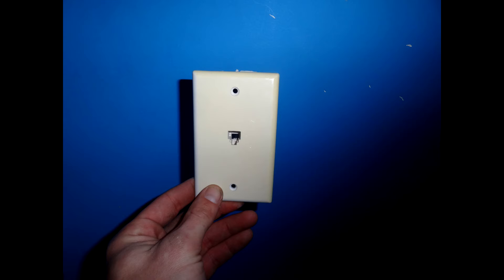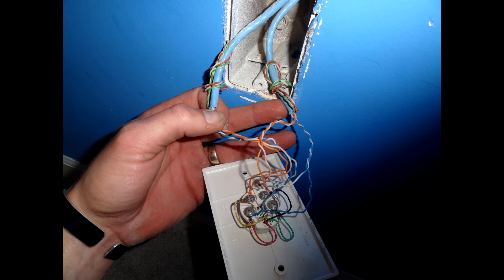Let's begin. Here is your phone jack in one of your bedrooms. Behind your phone jack, you'll see two Ethernet cables connected to it. One of them you're going to use for your Ethernet jack. The second one, you're going to use electric tape and just tie off that line because you're no longer going to use it, unless this is where you're going to put one of your dual data and Ethernet plates — then you'll use that for your phone line. For a regular Ethernet jack, you're going to tie off one of the lines. The reason there are two lines is because with a phone line, you can hop the cables, and that's what they did — they tied into a phone jack and just hopped the line.